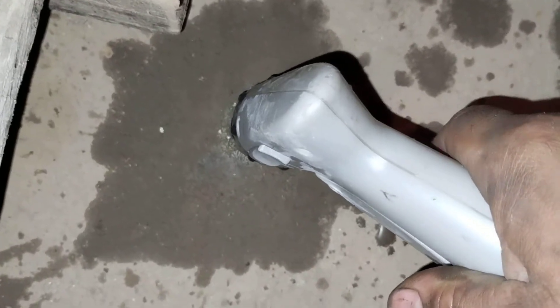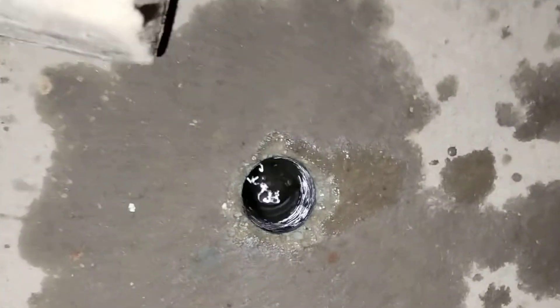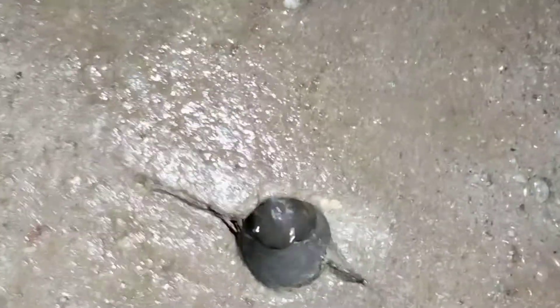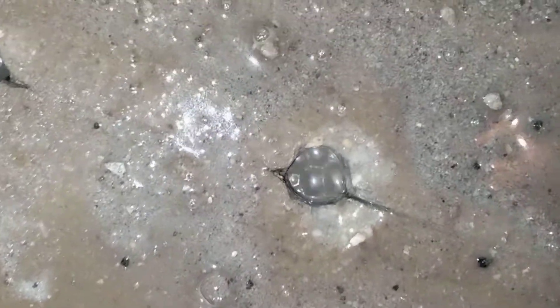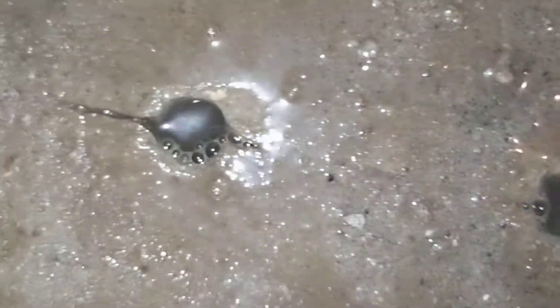Over here this one actually has more of a void, but I don't care because the concrete's not cracked. There it is — holding water now. It gives me a profile of the floor, telling me how they're interconnected. Water finds level, so it's coming up and there's a level. This one's actually full — the dirt is right there. I probed it and I'm at dirt.